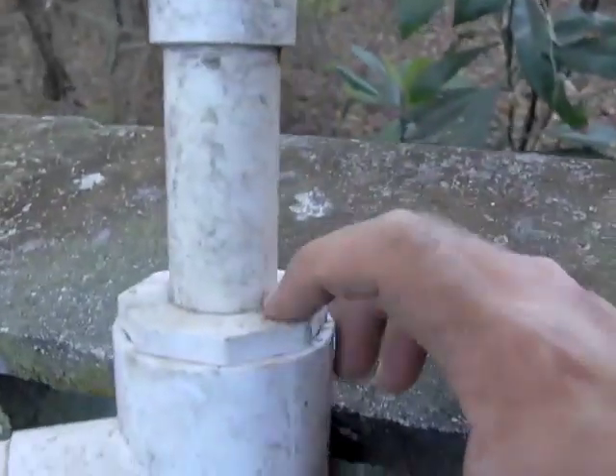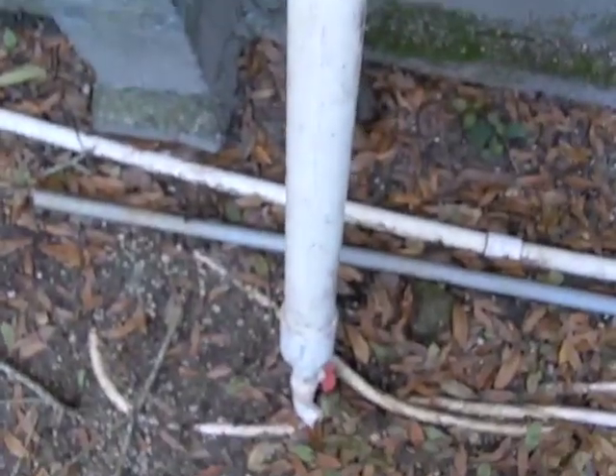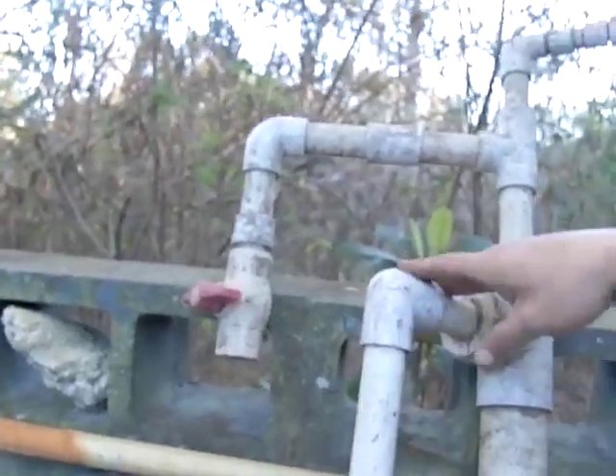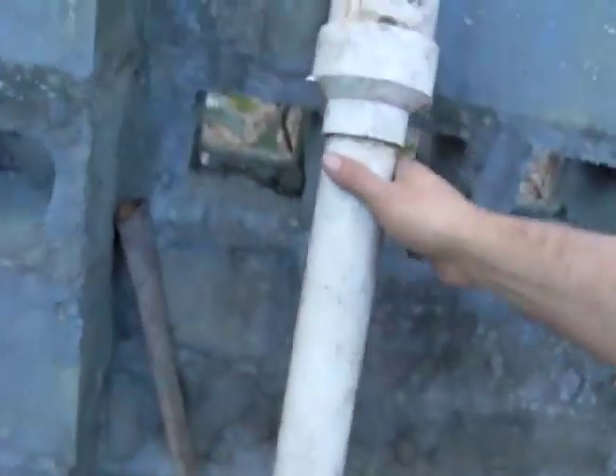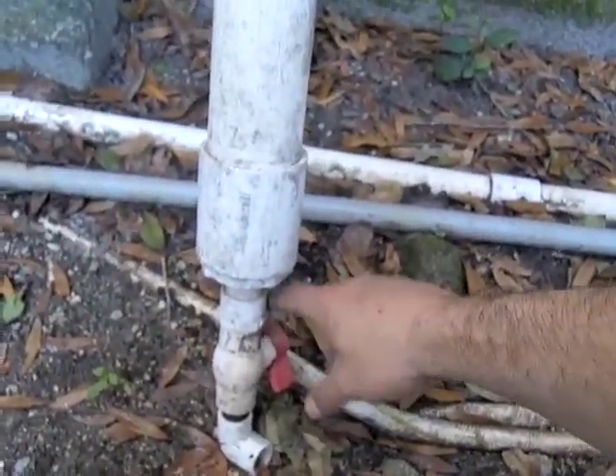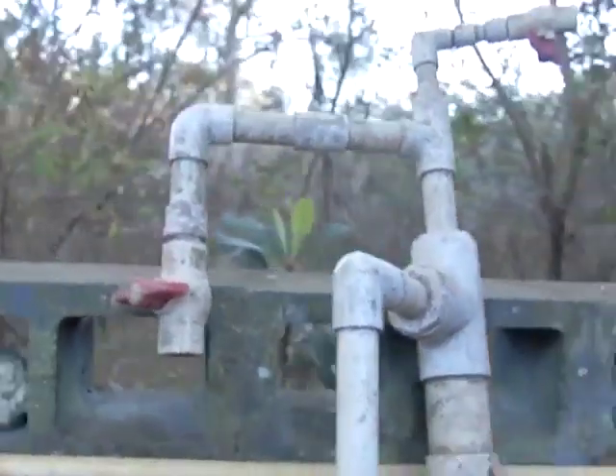I actually used the same technique for this big backwashable water filter that I made. We had a well that was going bad, pumping about six pounds of sand a day. To get the sand out, I put a well point in — the water would get sucked in, go down the outside of the pipe into a well point, which is just a piece of PVC with fine slits in it, and the sand would collect on the outside while the water went into the middle and out. I could backwash the outside so all the sand would blow out of the bottom. We finally had to replace the well because you shouldn't pump that much sand out of the ground — you can get a sinkhole in Florida. I'm your host Dan Rojas. Thank you for watching and enjoy our videos.